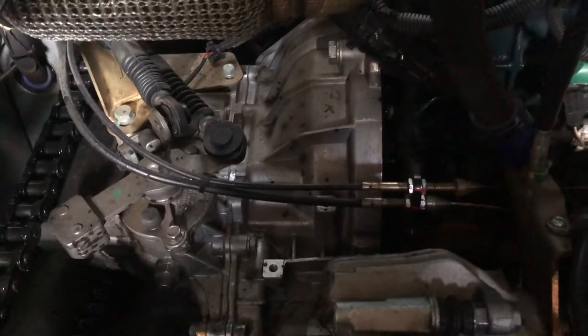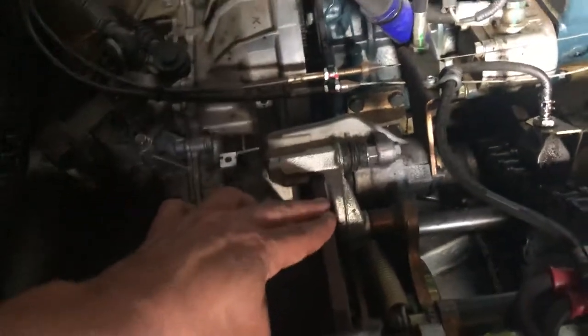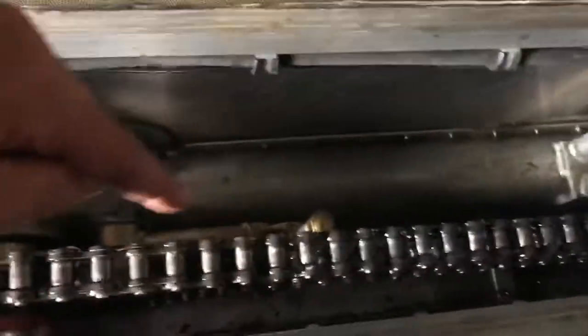That five-speed transmission then comes over on a shaft, goes across, and comes up to a chain. That chain is driving two different clutches - one on this side and one on this side. Each clutch has a brake on the inside. When I pull that lever back halfway, the clutch is engaged; pull it all the way back and the brake is engaged, stopping that side. Each side then drives a shaft, and that shaft drives two chains - one goes to the front wheel and one goes to the back wheel. So when I engage the clutch and brake on one side, that side stops turning while the other keeps going, making the whole vehicle turn to the left.